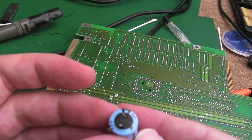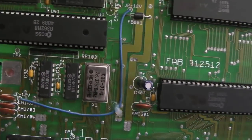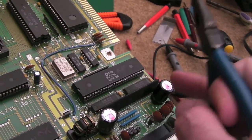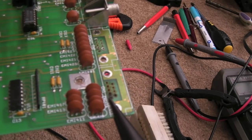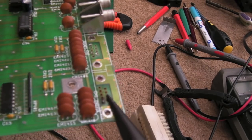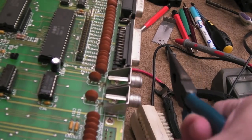There's a bit of discoloration around here which makes me wonder if that has leaked at some point. I'll clean up around there with cotton bud and IPA. Since they're exactly the same batch and the same brand, it makes sense to swap them both. I've got red dots on them - I'll mark this up at the end to say it's partially recapped with a red dot. Just squash that down - the ground piece of the connection was lifted off, but it will hold in place through the other side when the solder's on there.